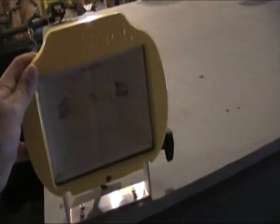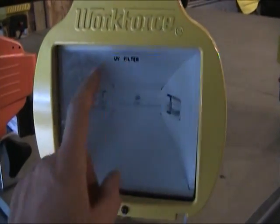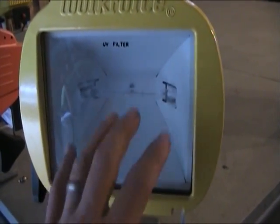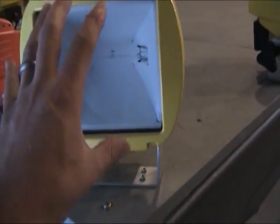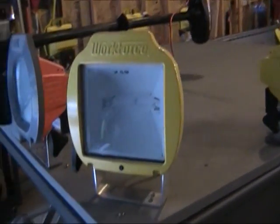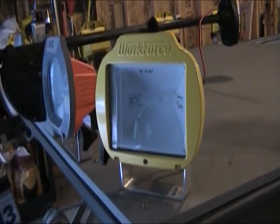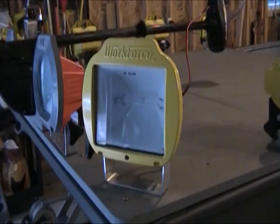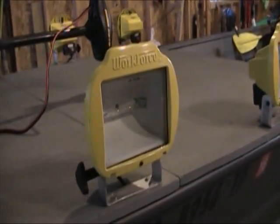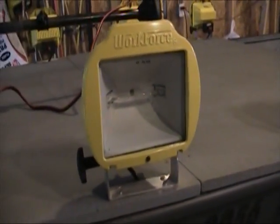With the lights — they're just shop-bought lights with 300-watt bulbs — what I did is kind of cool. I took the reflectors out and painted them flat white with grill paint: flat white barbecue grill paint from Home Depot. What it does is these lights usually produce a couple of hot spots where most of the light is concentrated. By adding that white paint in there, it takes those hot spots out and spreads the light beam real smooth, real even, and real wide. It doesn't give you more light, but it's a better use of the light that's available. I've been using it that way all season and I'm very happy with it.